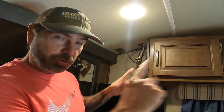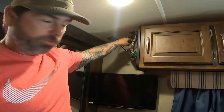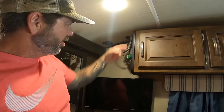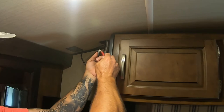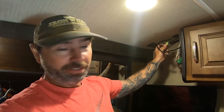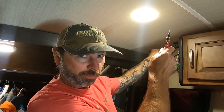The way mine is installed, there is a splitter right here. He used existing cable — the cable from where my box is in the living room and the cable from the box in our master bedroom closet go up and come in right behind the auxiliary satellite switch in the bedroom. Then it goes back up to the dish. So I've figured out that this is the cable coming from the living room. We need to see if we got voltage on it. Turns out we do.